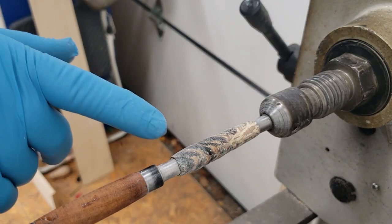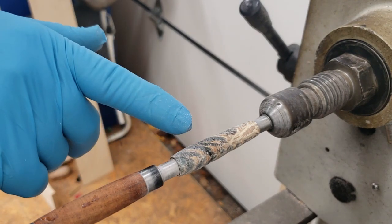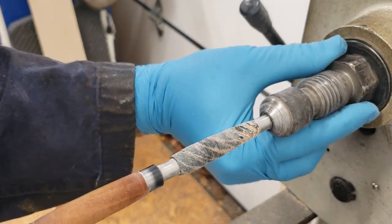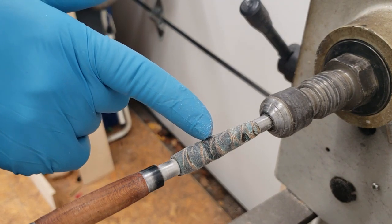This is an example of what I just mentioned — we held our hand for way too long in one spot, and we can see that little concave section right here. And if we rotate a little bit more, we do see a little bit of a deep gouge right here.